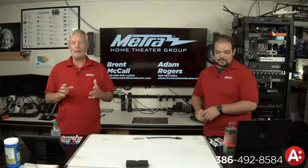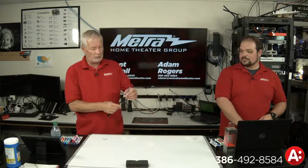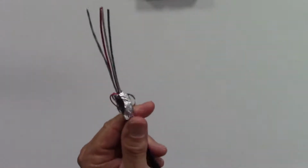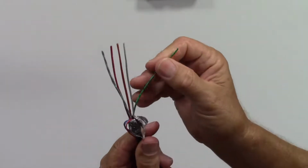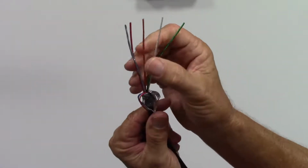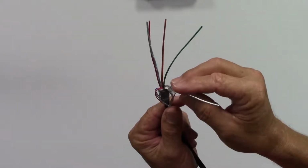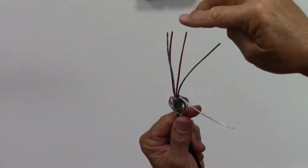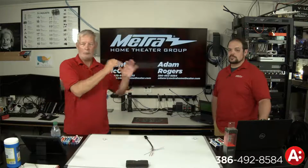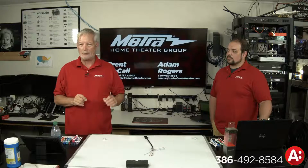So when you're looking at an HDMI transmission system, inside of the HDMI cable, let me give you the top-down shot. There are 4 primary TMDS feeds: RGB and clock. Now, there is an extra color in here that's shielded. This is the EDID channels, so we're going to ignore that, but we've got RGB and clock. The big thing that we're changing is what these data channels are going to do, but let's talk about how they operate first.